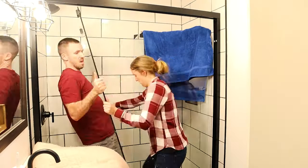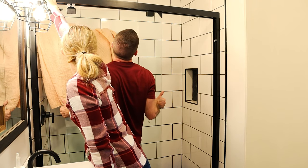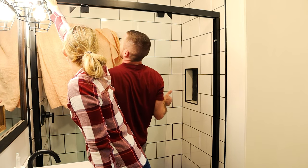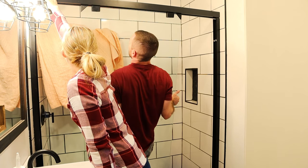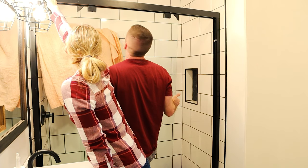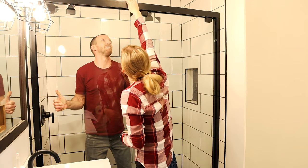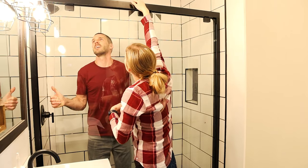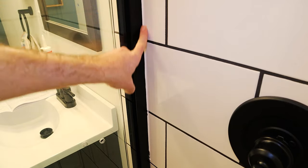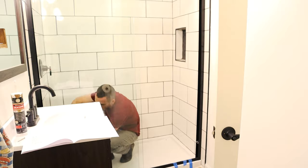First we brought both doors under and inside the shower area. It'll all make sense as to why when you're doing this yourself, but if you install one door you won't be able to fit the second door in behind it later. So both should be on your pan before you start hanging them. That actually took a lot more finagling than what I showed in the video, but all that's left is really just caulking around the shower — I caulked both inside and outside and really just made this whole thing completely waterproof.